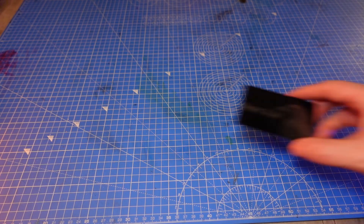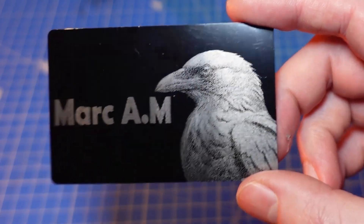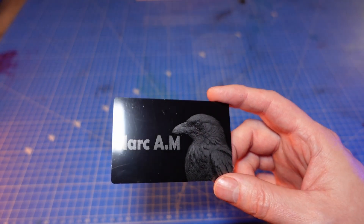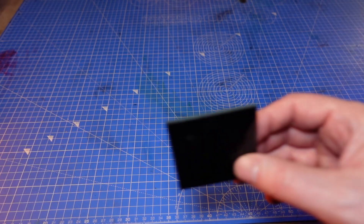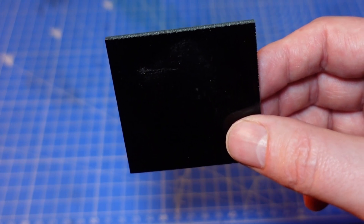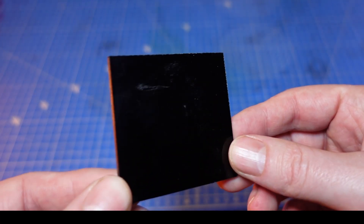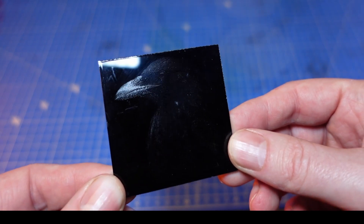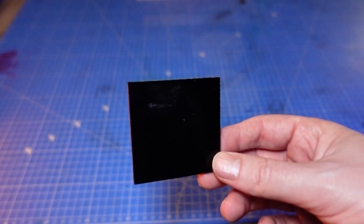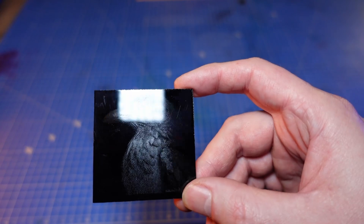It's the same image on a business card. This was my first time engraving an image on a business card, and it has come out really, really nice. You can see all the details in there, and the Mark AM text was just a solid vector — it flew through that in about 30 seconds. Then I did this on black acrylic. I put it on the lowest power — about 5% accidentally. If you look at it in the right light, it looks as if there's a 3D image on the acrylic. To my eye it looks 3D, but at one angle it literally looks like there's nothing there. I was really happy how this turned out because it's literally an invisible image until you put it in the right light.